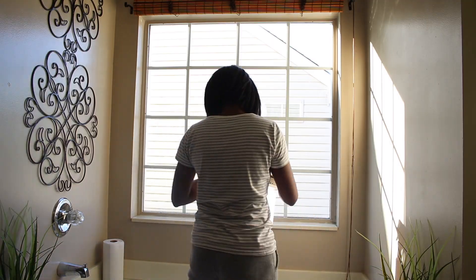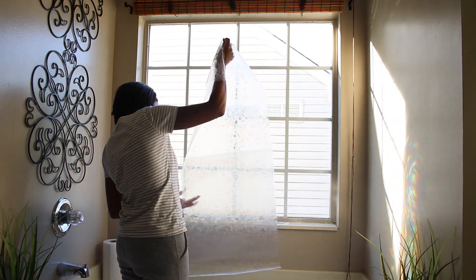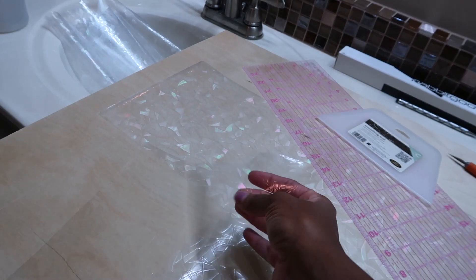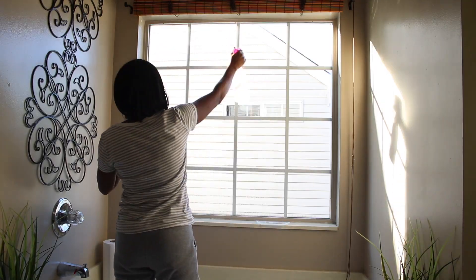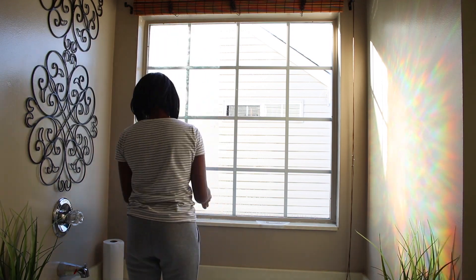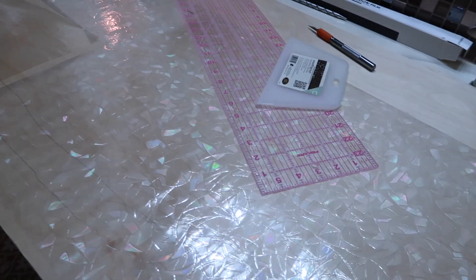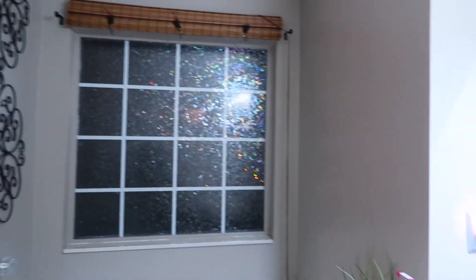After cleaning, I took my measurements, made my cut, then sprayed the area down with soapy water and removed the backing on the film. It's just a thin plastic backing. You apply it once you spray the window down with soapy water, push it into position, and use your smoothing tool to get out all the air bubbles. It is really easy to do. I did have to order a second one from Amazon because I ran out of the first one.